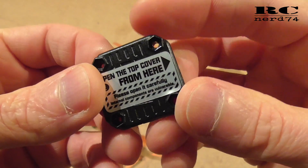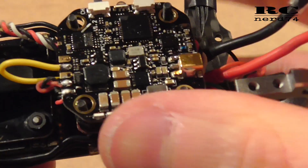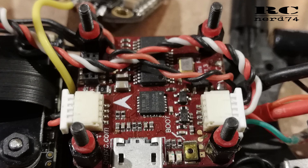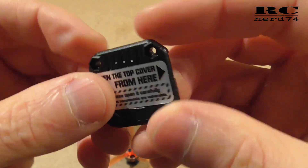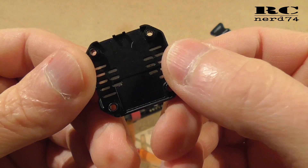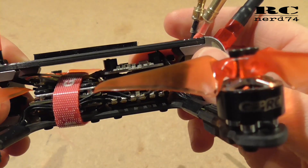If you install the VTX without the protection plate which covers the electronics, you have the issue that the holes in the electronics plate are three millimeters, not two millimeters, so the VTX can move on the screws. What I did is cut some cable insulation and placed it over the screws — like this the VTX fits perfectly with no more play. The reason I didn't install the protection plate is simply to keep the VTX as cool as possible, since covering the electronics makes it run hotter.